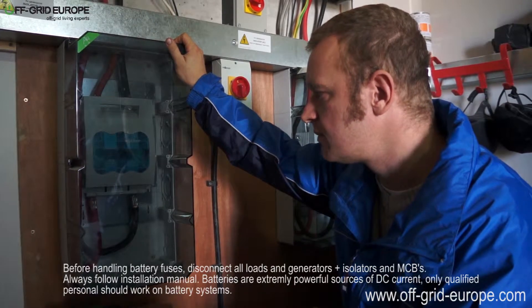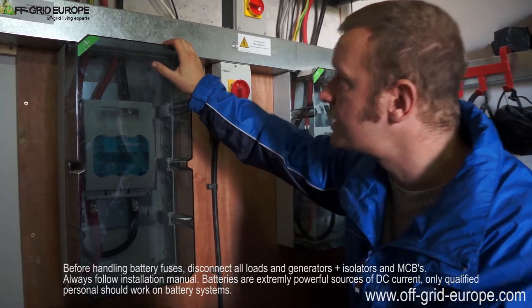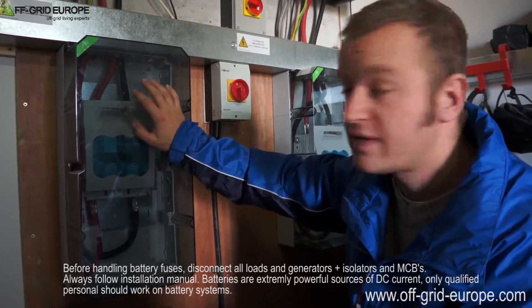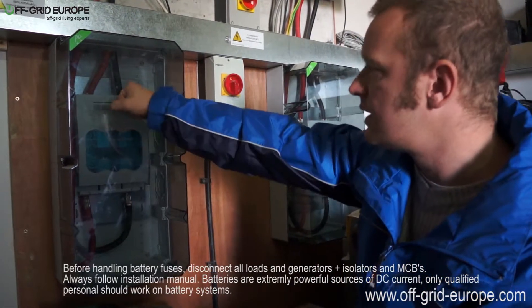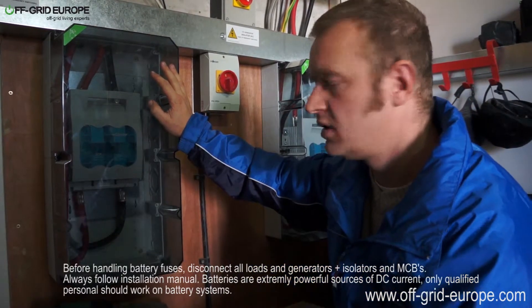As you can see, they've got quite a thick gauge of cable — this is 95mm² cable coming in and going out on both ends. The way this operates — I'm not going to disconnect it right now because that would cut the electricity from the house — but you would take this box off and then literally pull down the handle. It functions both as a fuse but also as a large circuit breaker.